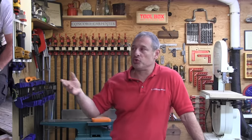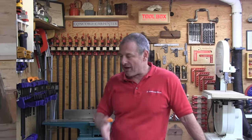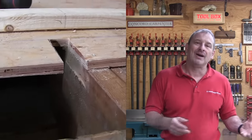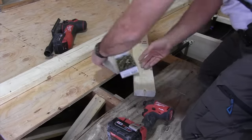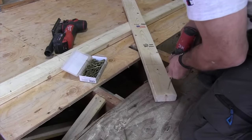So the question is, how many wall studs would you attach from that half wall? Well, you could do this on every single joist, or just a few. You can attach each 2x4 stud to the floor joist or to blocking — we can talk about blocking in a minute — with construction adhesive and 3-inch structural screws. I used GRK screws.